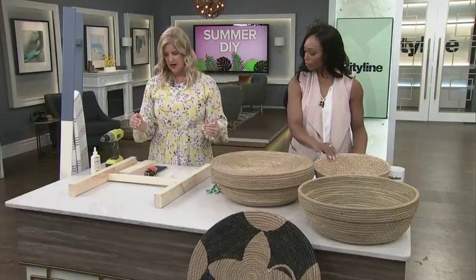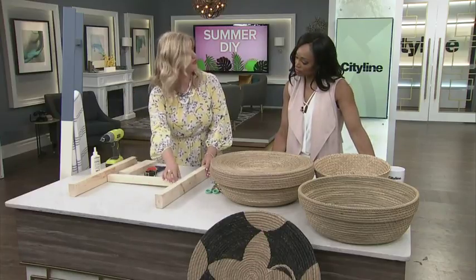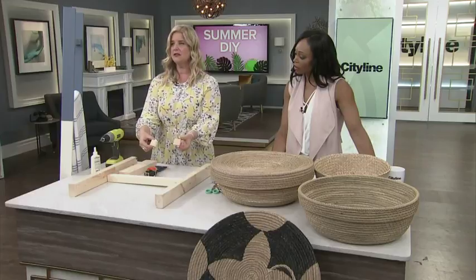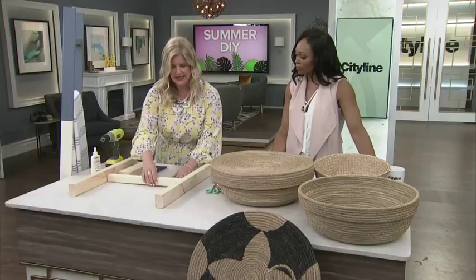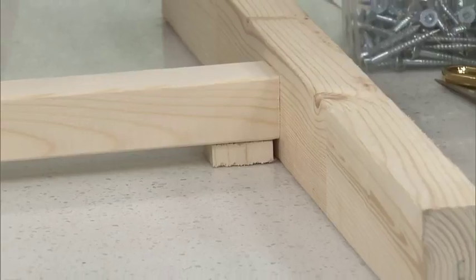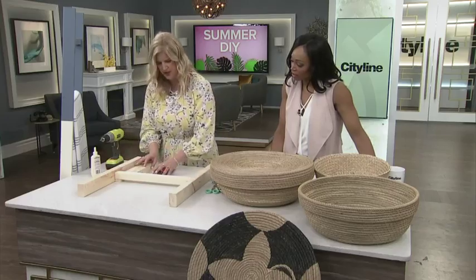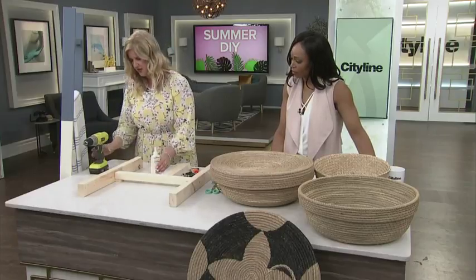I have two other tricks for this. You want these rungs to be centered, but you don't want to measure it or hold it in place the whole time because that's tedious and you're probably going to make mistakes. So I just cut two little wood discs that are the depth of how high I want the rung to sit. You slide one under each side, and it's automatically going to be sitting at the right height. These simple tricks make your life so much easier. Then you use a little bit of wood glue on either end, and you just screw them in.